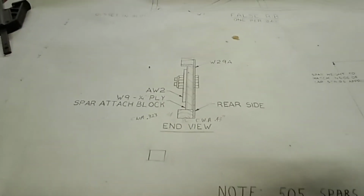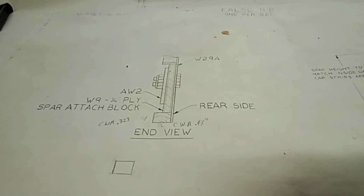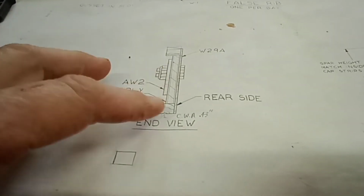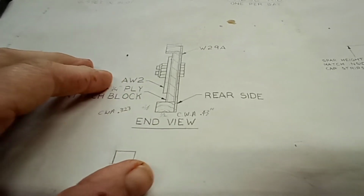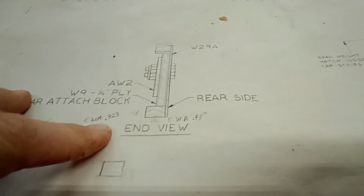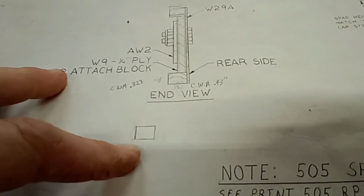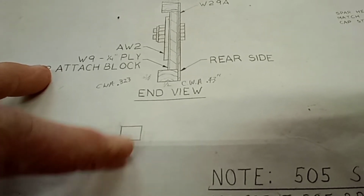Now, because I am using commercial white ash, and I reduce my size as much as I can, which is 86% in both directions. If I'm only reducing it in one direction, to get the same weight as Sitka spruce, I have to reduce it 0.7 in one direction. So this 1/2 by 3/8 would be 430 thousandths by 323. A lot of times what I like to do is actually draw that next to the actual, just to get an idea of how big a difference it is, and verify that I don't see an issue with it.